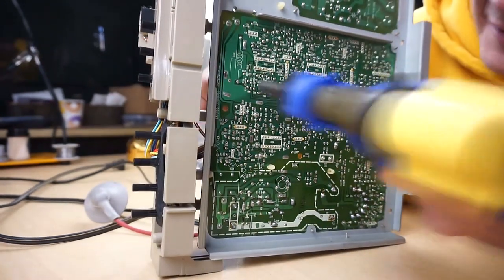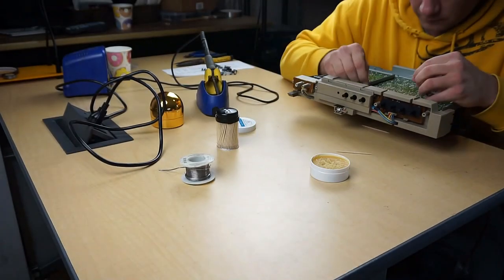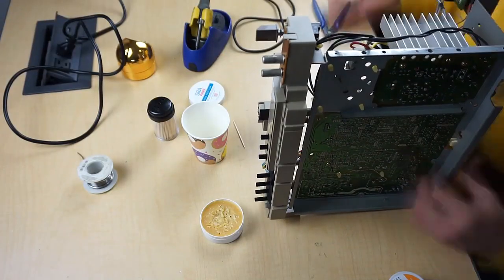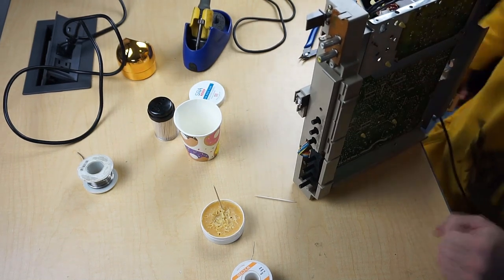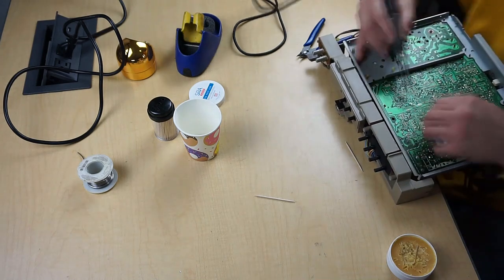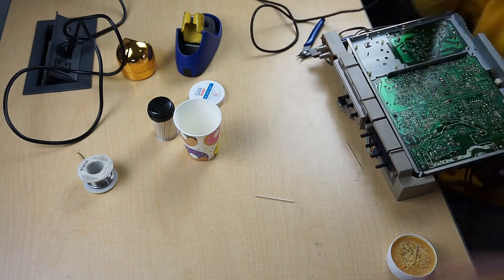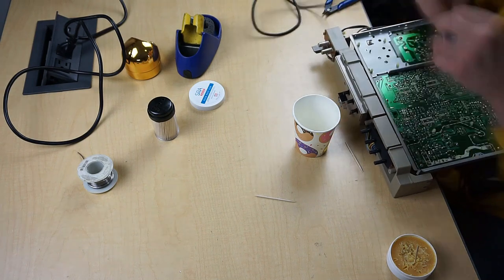There are plenty of other factors that you could consider when choosing a replacement capacitor. For example, you may need to determine what size your capacitor will need to be, if it needs to fit in a tight spot. Sometimes your capacitors will be significantly smaller than the ones you are replacing. They may have compacted a lot of the size and the design needed to get the same performance or maybe even better performance than old technology from the 1980s. And so thus you will often run into capacitors that are a lot smaller in size than the one you may be replacing. So when you pick out a capacitor and the size is important, just try to make sure not to order something that is larger than the one you are replacing. You want to try to make sure that the capacitor is always the same size or maybe even a little bit smaller.